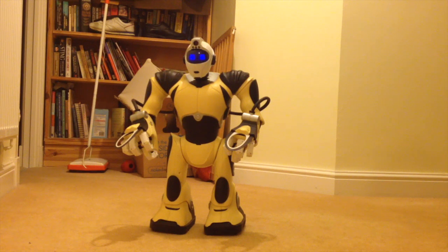I just did a test to see if the Robosapien V2 will lie back and then get back up again. He laid back okay and got down, but he couldn't get up. The reason is the batteries I've got in him are nickel metal hydride rechargeable batteries and they weigh a fraction of the weight of normal Duracell-type batteries. Therefore, I don't think he had the weight in his feet in order to enable him to get up. He only gets back up again because of the springs in him. He checks his sensor to see if he's upright and his response is 'bad motivator,' but that isn't a motivator problem - it's actually down to his weight. I'll have to test that now by putting in some heavy batteries and seeing if he can get up himself.